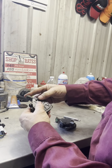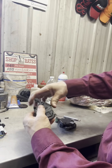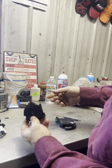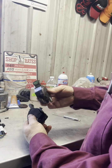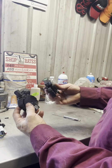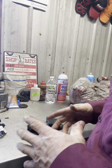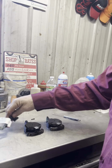There we go - we have our remote, it's all ready. I'm gonna try the detent part: push down like that - there it is, it's locked in. We're good to go. That's how you put together an SCV control switch. This is the same way even if one of the other ones goes bad - this is how you'd have to put it together. I'm going to get up in the cab and show what we have to do for mounting this switch into an empty port and where this new wiring harness hooks in.